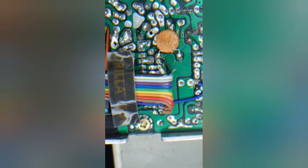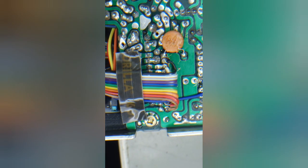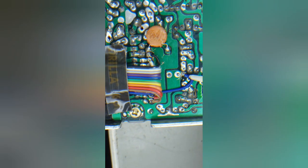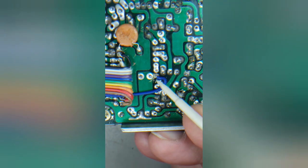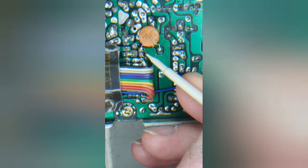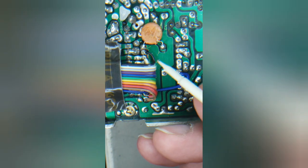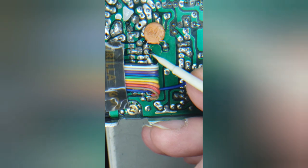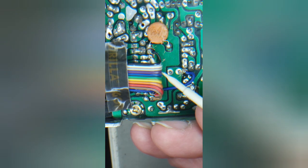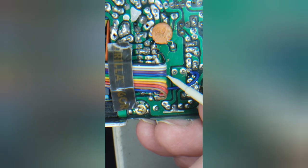Hello YouTube. So this is the 858 Ferris SSB-5000 — just wanted to show you the connections for the CB40. First of all, this is the 5kc/10kc pin, and we isolated that by cutting through here. Then we have P9, which normally had these two joined together — I did a horseshoe cut up and across, then soldered the black wire. The other cut was on the violet line, and I separated that from the main track here.